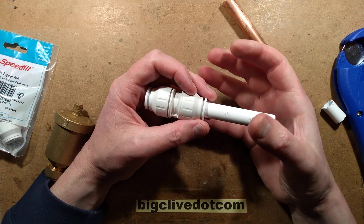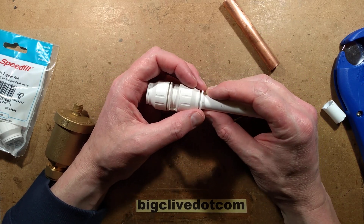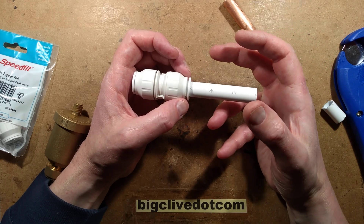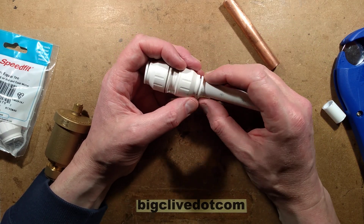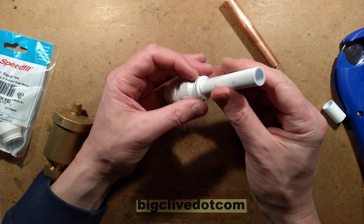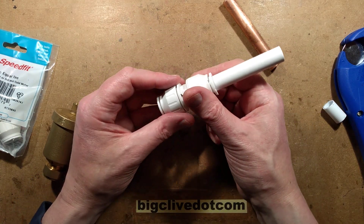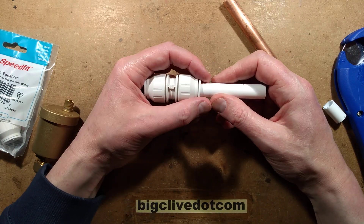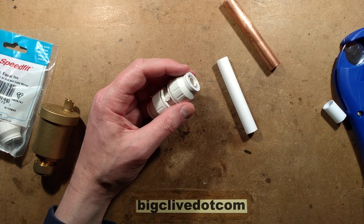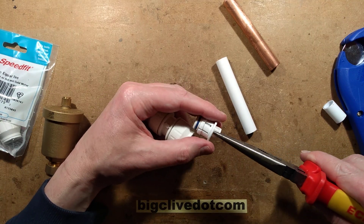Initially I was thinking I'd be so worried about using that at mains water pressure, but there are videos on the internet — I'll link one below, Ultimate Handyman I think — where the guy pressurizes this to see at what point it fails. The pressure it withstands is ridiculous — hundreds and hundreds of pounds per square inch until it finally gives. In many other videos when they pressurize it, it splits the actual plastic pipe, which is fairly thick with a sort of multi-laminated layer. So they do seem quite good. The advantage of this one is that you can loosen it off and pull this ring in to remove the pipe, though every time you do that it leaves that little insert in there. They recommend just grabbing that with a pair of long nose pliers and hoiking it out.